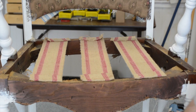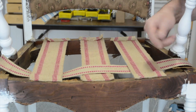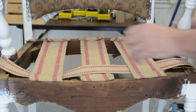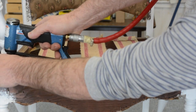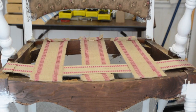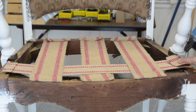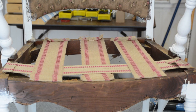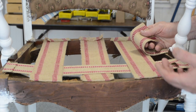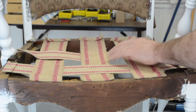I do not need the webbing stretcher for the side-to-side webbings, because we don't want to take the curve away from the seat. So we're going to hand stretch these. I want to start under, over, and under — that's actually an important way to start in the front, because if you went over, you'd come off the curve. The idea is not to come off the curve. You don't want to tighten these too much; it's a very light stretch that goes with the curve. You know you're pulling it too hard when it comes off the curve. The next one we weave over, under, and over — opposite the first one.